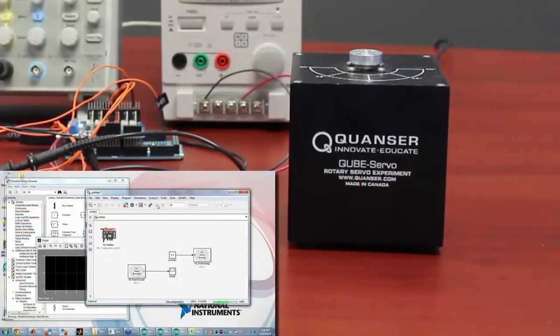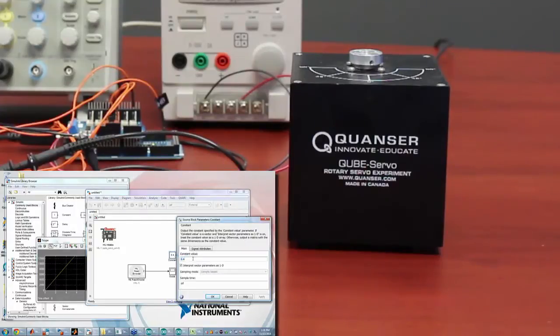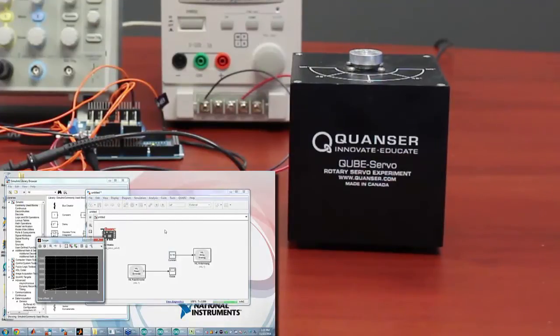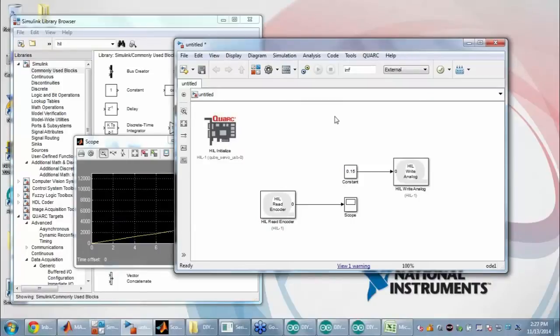I'll build an external model for real-time code with reliable timing, connect to my target and run it — and just like that my cube servo is moving and I'm getting encoder values. That took about two minutes, versus at least two to three hours for the initial DIY setup. Now, comparing friction: if I bring the voltage down to 0.15 volts — 150 millivolts — rebuild the model, connect, and run, you can see it's still moving solidly. That's less than half the voltage required to move the DIY solution.